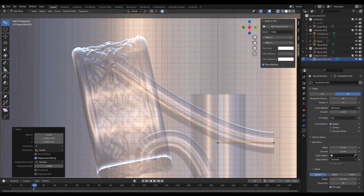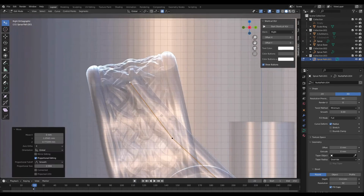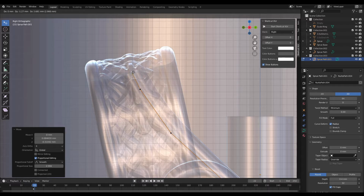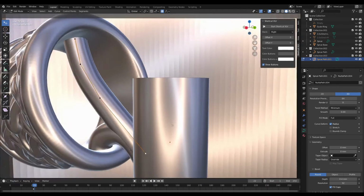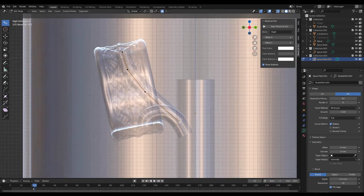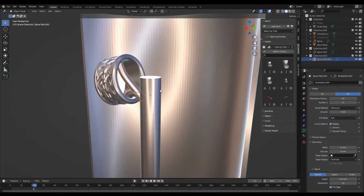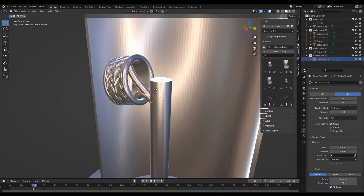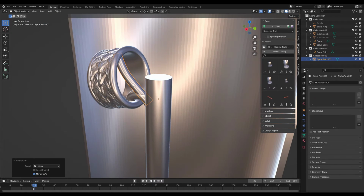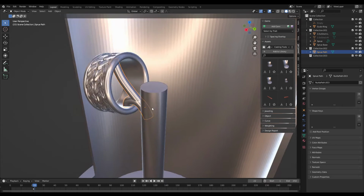Because at least from what I understand, any sharp corners in that path for the metal to flow is going to create turbulent spots where the metal can churn up, and it could break away pieces of investment and end up causing voids in your casting or even make it solidify prematurely. So it's best to make it as smooth as you can and really think about how that metal is filling up the cavity.